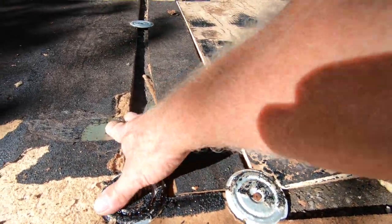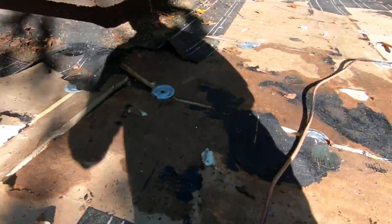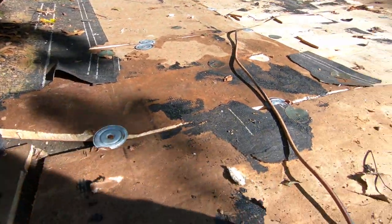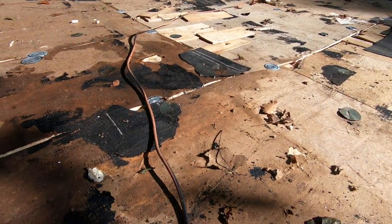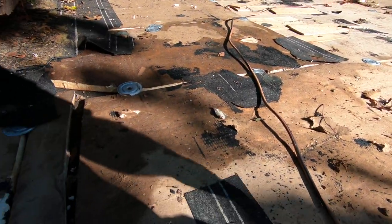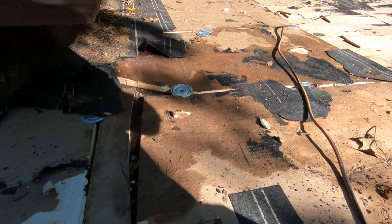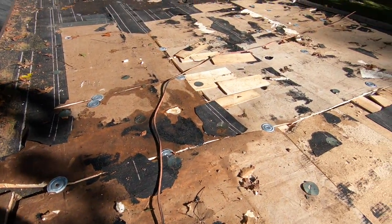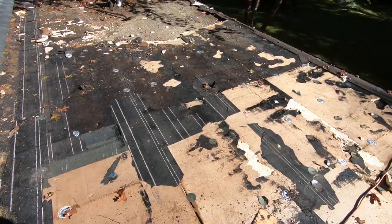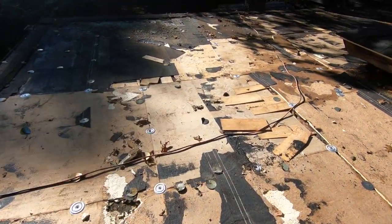You can use anything, that's fine, but do a nice job. Look at the spaces between here and the cuts — very, very badly done. And look, it's wet here — it was leaking. This roof was leaking to the next layer, to the next layer. That's why it's decomposing. It smells very bad because it's decomposing. After five years or so this roof would be a disaster.